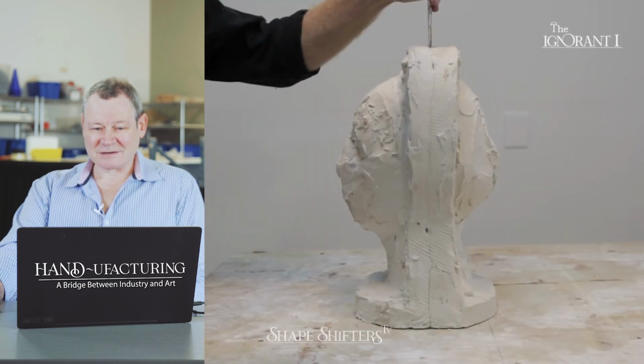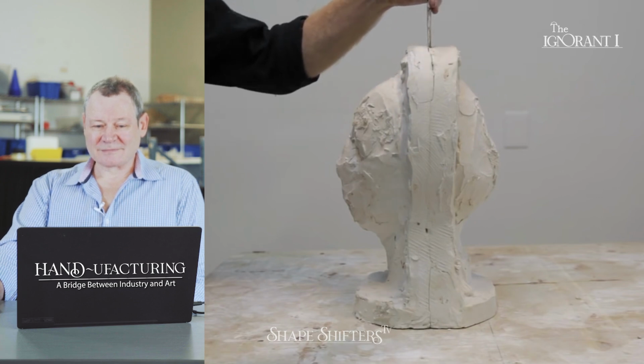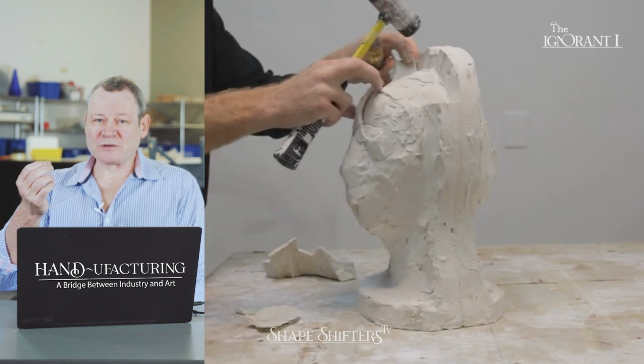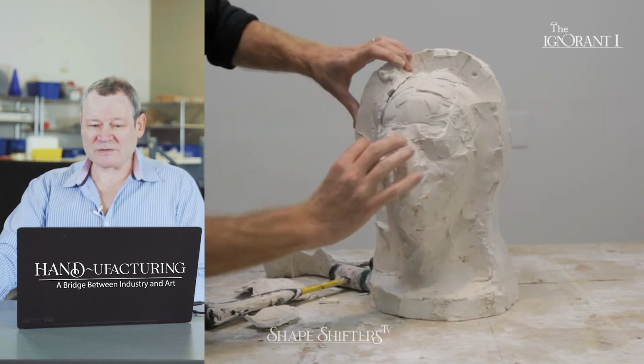Again, I start at the top of the mold, and I tap lightly at first, trying to open that small seam. If you made your mold too thick, this is where you have trouble. It should just kind of crumble off.